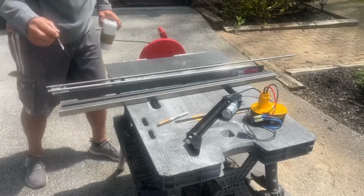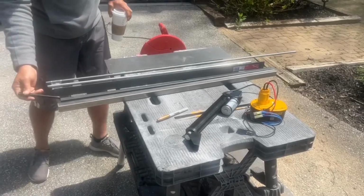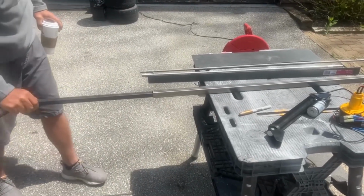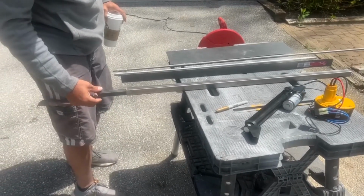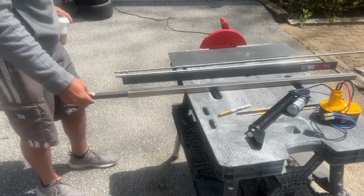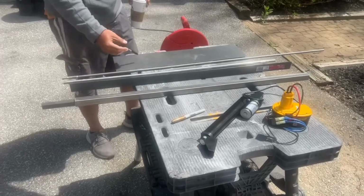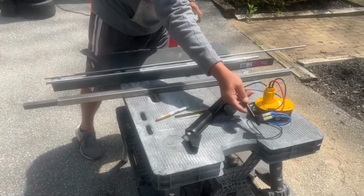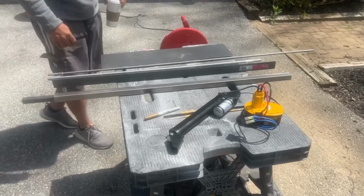So that will hinge with a tab that'll connect to the linear actuator that'll be mounted to the back of the L channel. And then the smaller tube will allow us to telescope the size of TV that we're going to leverage. So we'll drill a single hole here and a series of different holes here to adjust for the different height capabilities. So probably anywhere from a 10 inch TV to a 40 inch TV, that'll give you the depth. And then we're basically using the steel sheet to create the mounting bracket to the back of the TV. Hopefully all together, utilizing a momentary switch in either direction, it'll allow this thing to close up or come out from underneath the storage unit.